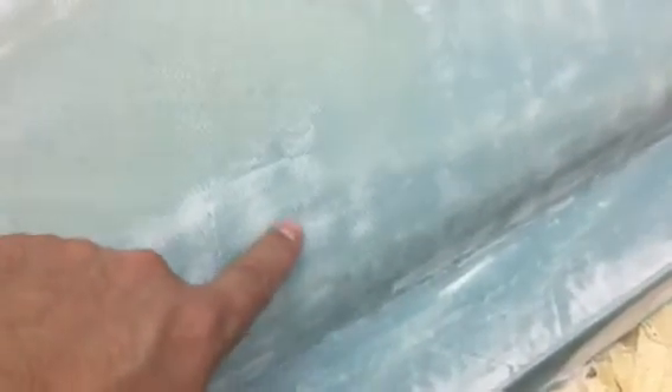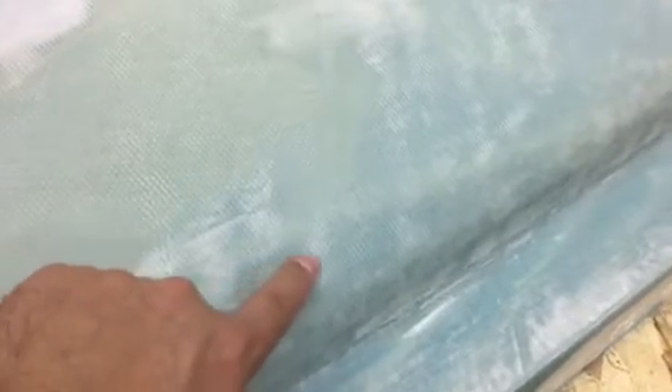As a result of proper filling and sanding, we see a pattern of vertical stripes. Believe it or not, that is the kind of error introduced by the software, both at the solid modeling level and more importantly at the level of the CNC machine. When you're programming g-code you give a certain level of variation tolerance — we set ours quite low, half a thousandth of an inch. What happened — and this is the first time I've actually seen it — is that we have half a thousandth of an inch of step height difference as we move along, because the code is interpolating for the Cartesian coordinate system. You can't feel that in the machined part by hand, but when you fill it and sand it, it starts to emerge.